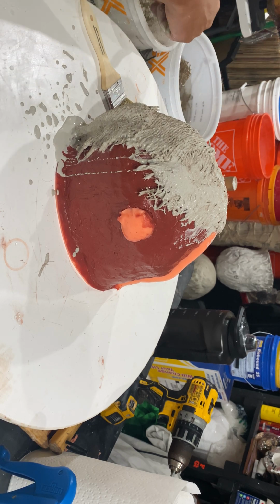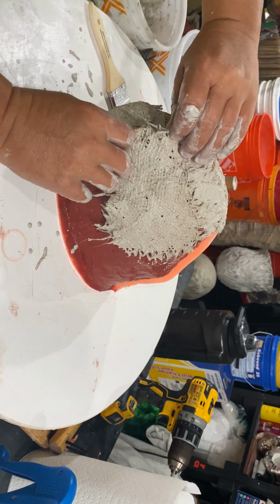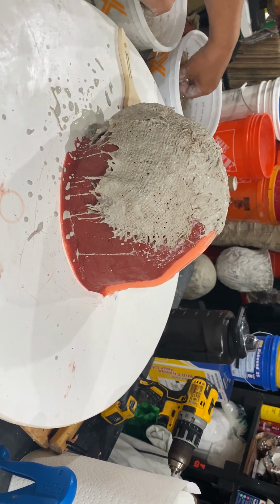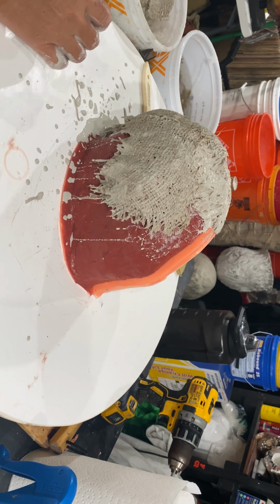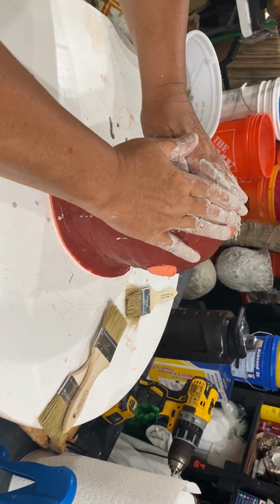Now I've made the plaster fairly runny. I don't want this plaster shell very thick. I don't want it to weigh 1,000 pounds. Now, we want to cover what we did, not where I didn't go yet. Now this will get another outer coat once I have this side established. And so what I'm doing is I'm going right up to this edge. And this is going to be part one to making this hard shell.